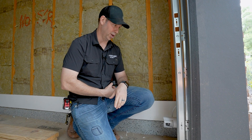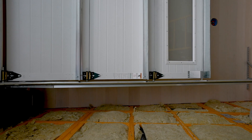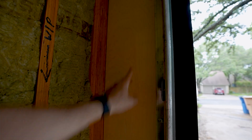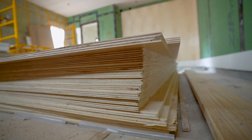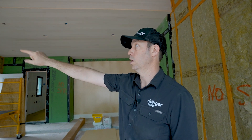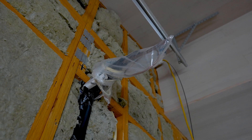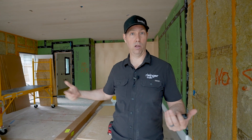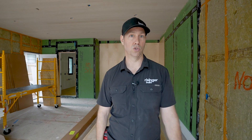Just like the ceiling, I had my finished carpenter put this front wall plywood in before we hung the door, so the track and WireHide go through the plywood. That's three-quarter maple plywood as a finished wall so I can attach things to it. It's also keeping this garage fully insulated, which is a big reason I wanted this insulated door. I've got a Mitsubishi mini split head going in the corner. In the summertime I'll set it to about 80 degrees so the garage never gets hotter than that, and in the winter around 60 degrees. My garage fridge and freezer will operate really well, and I can use this space as a workshop — it'll be my man cave.